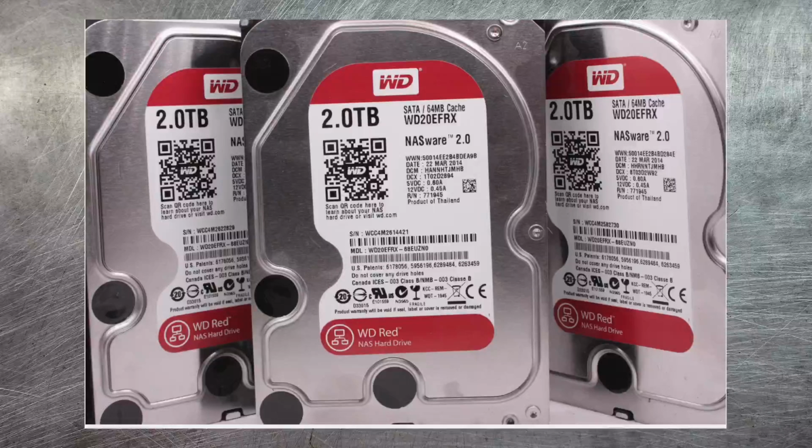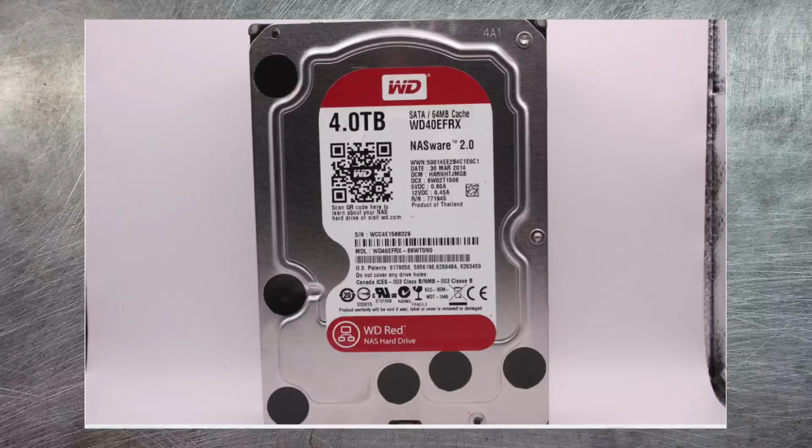However, don't feel you've got to use something like this. You could use any disks you like, but just bear in mind they really do need to be the same size. You can technically use ones that are different sizes, and I'll show you how to work around that later. However, you will be limited as to whichever one is smallest, and that will ultimately govern the capacity of your array. So it's best to get 3 that are the same. The 4th drive I'm going to connect, I'm going to use for backups. Now this is deliberately sized as twice the size of the smallest hard drive that I'm using in my data array. And again, the reasons for this will become clear later.